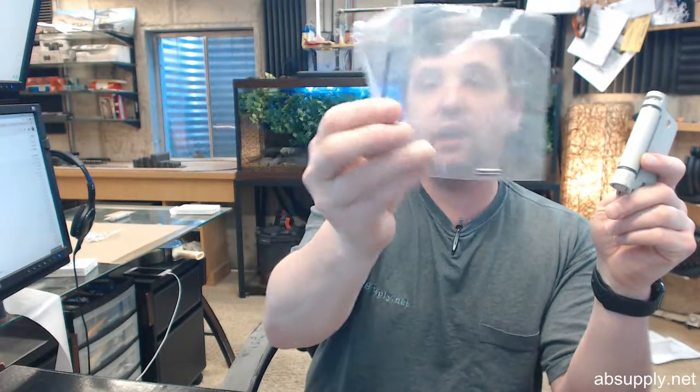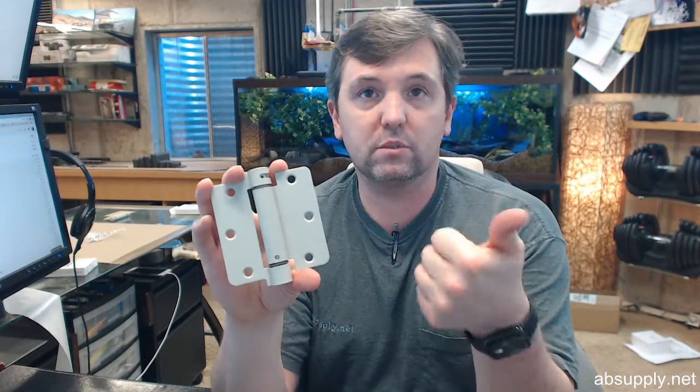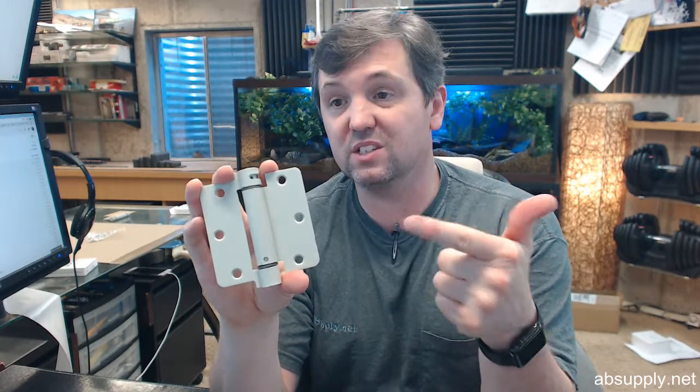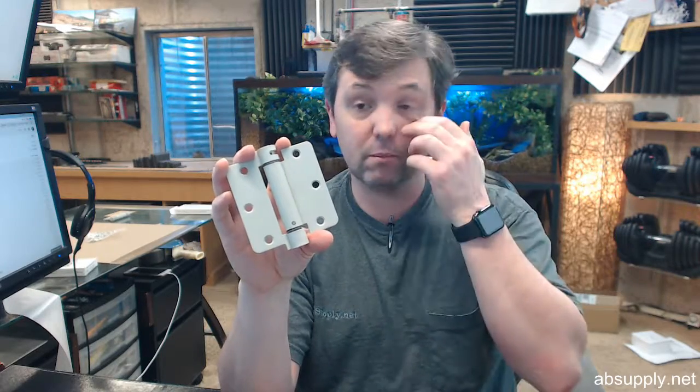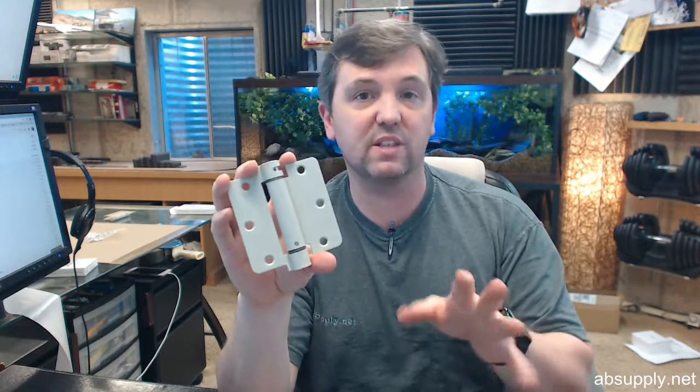Okay. So we've gone over all of the documents down below. Tension pins and tension rods are available separately. There are links below this video to those. This hinge is going to be available in every typical and atypical finish. Not only prime coat, but 601 for bright black Japan, zinc coated, all your brasses, your bronze, your chromes, your nickel, satin polished, antique, oil rub bronze. Bommer will basically put any finish on this that you want.